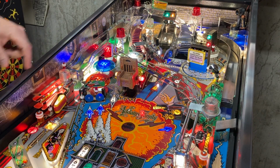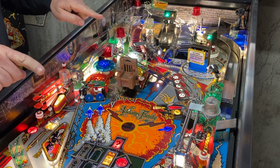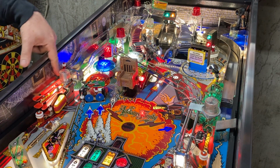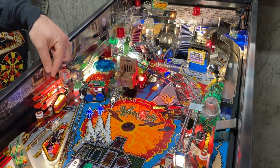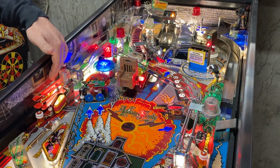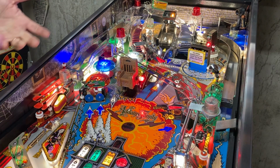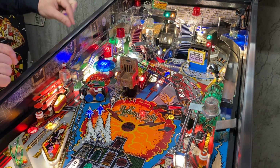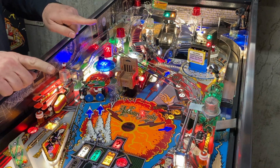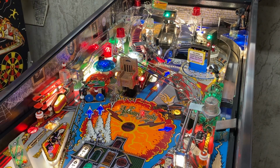Okay, moving right along here, there was an LED strip that was added here, but it was put on a bracket to actually aim it more towards the playfield. This was one of these trial and error things. When I originally put it in place, it was in place of just a single bulb, laid on the bottom plastic and shining up. Well, the problem was that it was glaring off of the side walls, and once you see it, it starts to bug you. So I built just a small little bracket that repositions that light strip to shoot it towards the playfield and help light that area out without glaring in the face of the player.